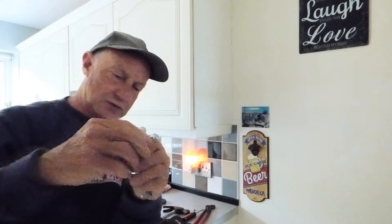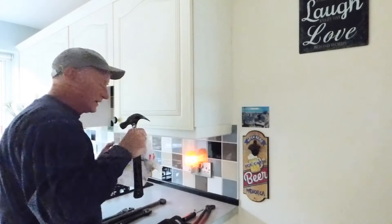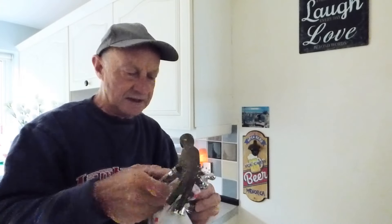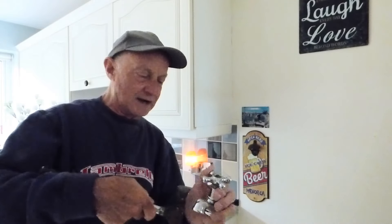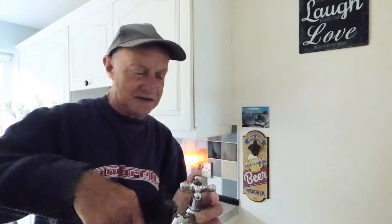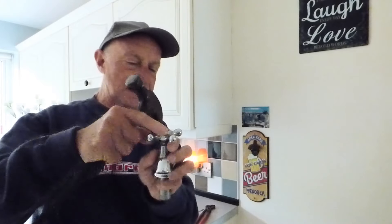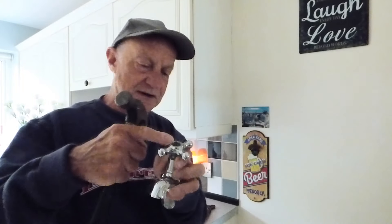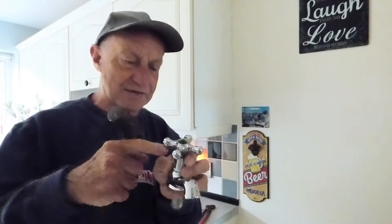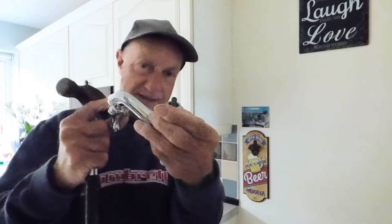These tops sometimes are really hard to pull off. If they are, that's when you get the trusty hammer and give it a tap under there. If you're worried about marking it, this is where you need a bit of cloth like so - under there and give it a tap up. It's awkward, it's a hassle, but it has to be done. If they're tight, just tap gently, turn the tap around another notch, give it a tap, turn it around another notch. Just do it gently, gradually. You can spray some WD-40 down there, which really helps get these tops off. Plenty of that lubricant on everything - it will help. Keep tapping and it will eventually come away.